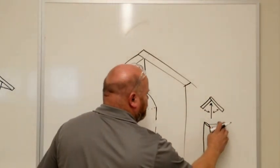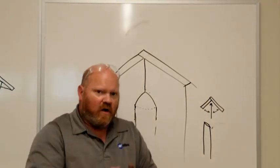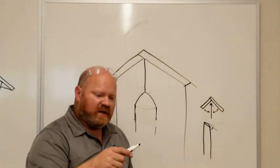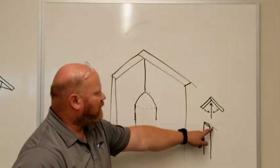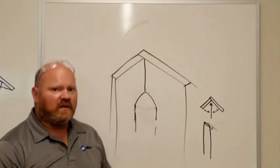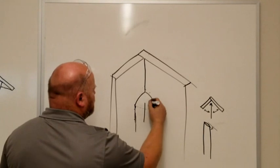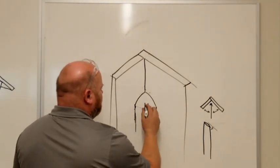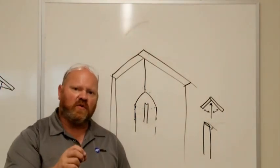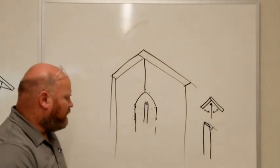If you're one of those folks that starts with your gun pointed upward and then tilts it up rather than lifting your arms, the wire clearance will decrease, and a tiny movement up and down will cause the wire to touch the front edge of the puddle and burn back by a quarter inch — almost instantly. Keep that wire low. With 0.052 diameter wire, when tuned in smoothly, you can physically see the outer sheath of the wire melting back and the flux shooting out of the center, and then the arc fans out to the side.